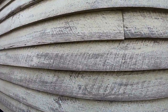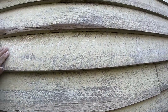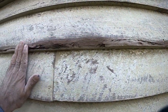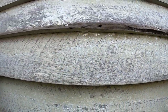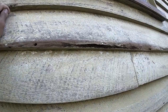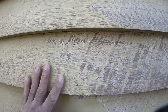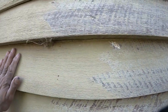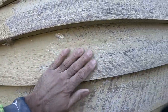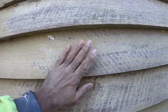We don't go back too far — this is still stable, this is still fine. We do the bottom edges, and anywhere the timber's rotten, cut it out the best we can — cut it out, get rid of it. We won't plaster it. Cut that back there, get rid of that dead wood. Most people just paint over that, but if you put the sander on it for a couple of seconds you can see this here isn't stable — it's not stable. This part here is stable.